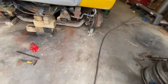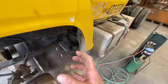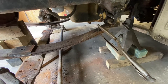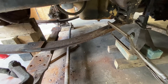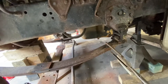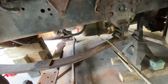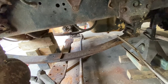The springs came out no problem — I just took those clamps at the back and used my hand sledge to bend them side to side so the spring could drop out below the packs. They're not going to be reused. I'll go to my local spring company, take some pictures, replace those center bolts since they're all rusted and marred up, get some shorter ones I need anyway, and find some sort of tension clamp to locate the spring and keep it from moving side to side.